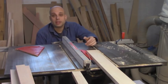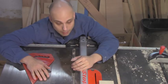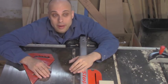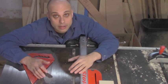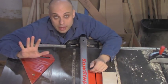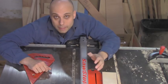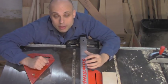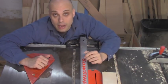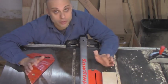Here's the exact setup that I was using when I injured myself, and I'm showing you this because I want to talk about what happened. The scary part is I don't actually know what happened, and that's the terrifying thing about table saws — they're so much faster than human reflexes. By the time you know something has gone wrong you're already injured. I know I was ripping long stock, and I'm always very concerned with my right hand when doing ripping — and my injury is to my left thumb. I was clearing away some boards to make a cut and then all of a sudden I had this incredible sensation of impact against my thumb, like it had been hit with a hammer dead on. I looked down in time to see the saw blade bite into it, and then it was over. It was that quick.